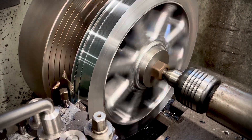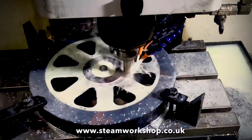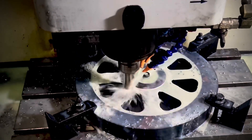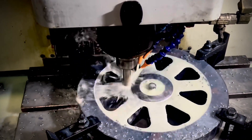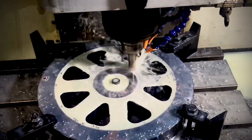After those initial turning operations it's transferred to the CNC milling machine where the more detailed profile can be added to our CAD drawings, so the triangular flame cut sections can be profiled and radiused and made to look much more like a traditionally shaped spoked wheel.